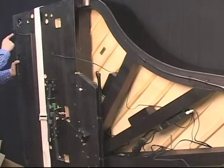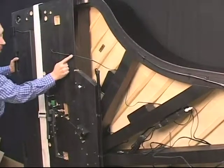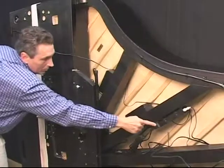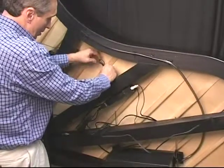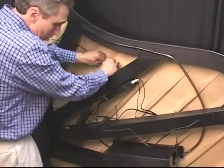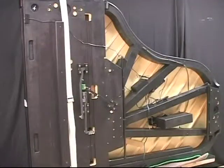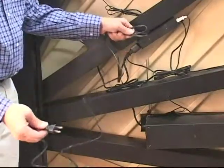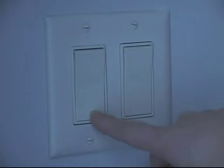3 1/8-inch clamps with 1/2-inch screws are used to hold the light panel wire from the point of installation of the panel to the humidistat. Now that all the components have been installed, the excess wire from the dehumidifier and the humidifier cords can be concealed by using a combination of wire ties, cable ties, and the remaining clamps. The humidistat power cord can now be plugged into the wall outlet. Be sure the outlet isn't controlled by a switch.